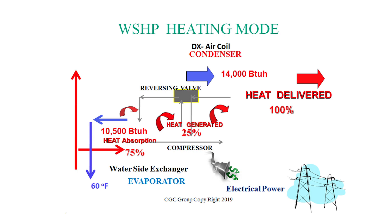It has to do with these temperatures. That evaporator is seeing 70-degree water, but in cooling mode the air temperature would be warmer — 75, maybe even as high as 80 degrees. So there's more energy and more temperature difference for higher capacity. In the wintertime, that is a fairly low evaporating temperature, so we get less cooling out of the unit and our heat delivered is slightly lower. Our evaporating temperatures are a little lower in heating mode, and that's why we get a little bit less energy.